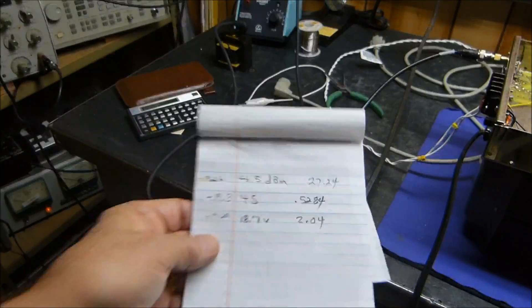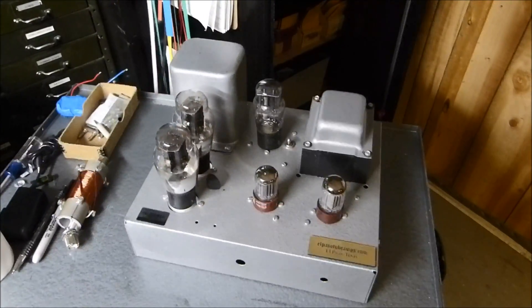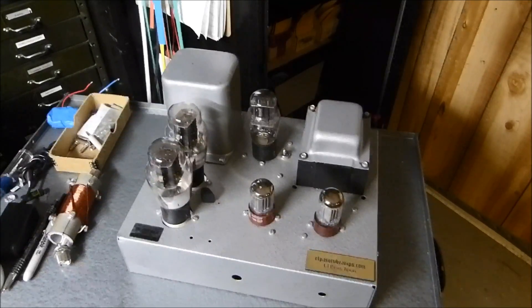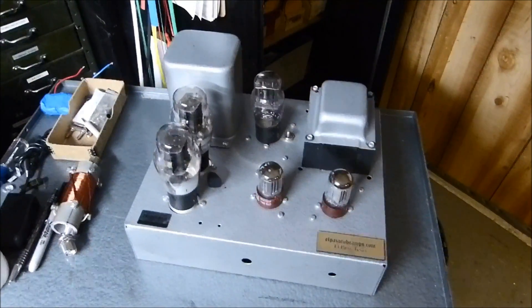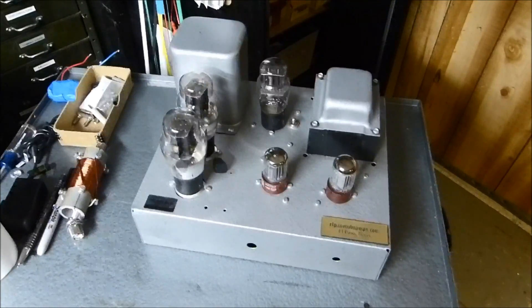If you're not familiar with decibels, it's actually pretty easy — though you do need a calculator. It wasn't so easy back in the 1960s when you think about it. Now, this amplifier right here: if I go to more than about minus 16 dB of feedback, it starts doing very strange things at low frequencies like 20 Hz. These 6B4Gs perform really well — you can get a good 20 watts out of them. This one runs about 560 volts on the plates; yes, I know that's a bit high.